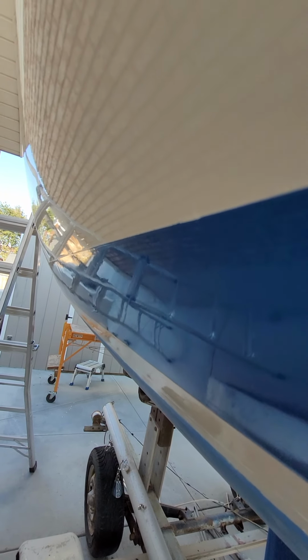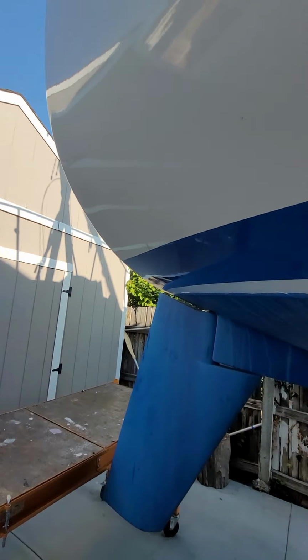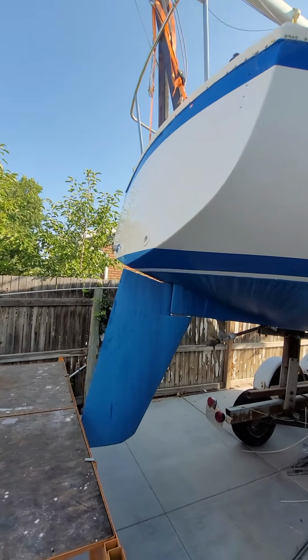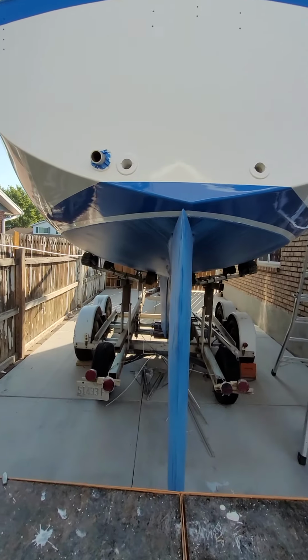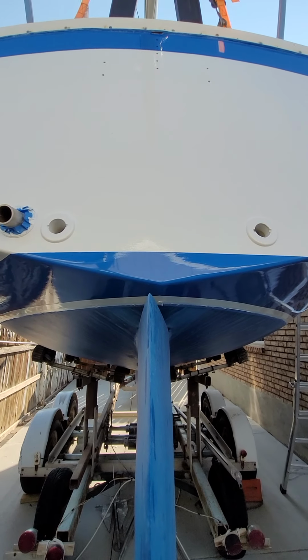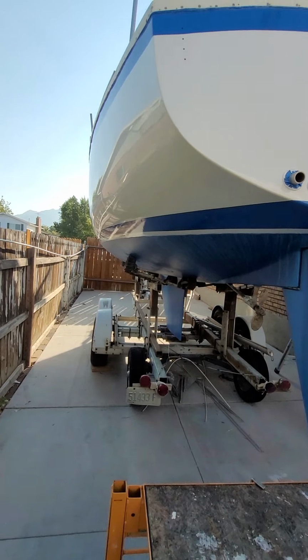That's the gloss finish. It'll flow out right if you do it right. It's not spray job quality, but I'm not a pro painter here, and my ability to spray probably wouldn't look any better. If you do a roll and tip and take your time and do it right, it'll look really good.